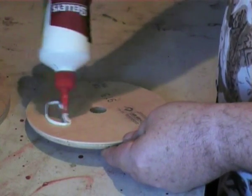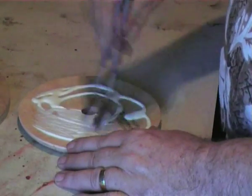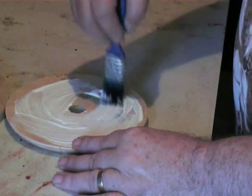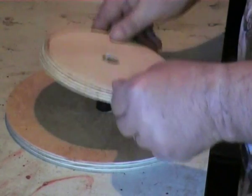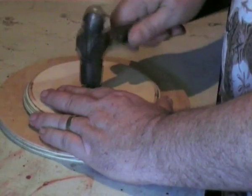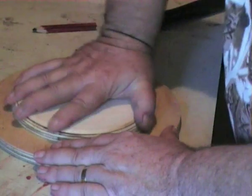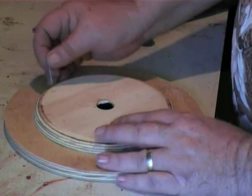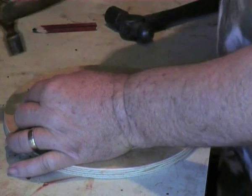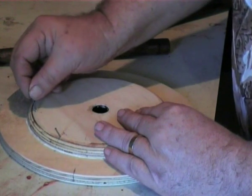Apply ordinary woodworking glue with a brush, and just brush it all the way over so it covers the entire surface area for a good bond. Take our disc, place it over the top, and just give it a tap in place. Give it a turn — that drives out any air that's trapped in there. At the location where these depressions are, tap the nail in part of the way, lining it up where the start of the rad is, and driving it in at an angle.